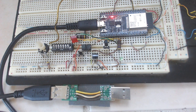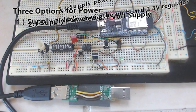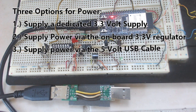When it comes to an ESP32 project, you've really got three ways you can power it. You can supply 3.3 volts to the 3.3 volt pin. You can supply 5 volts, or maybe a slightly higher voltage, to the 5 volt pin and let the onboard regulator supply 3.3 volt power. Or you can use your USB cable and let it power the device. I'm going to look at all three of these in a little bit of detail before I make my opinions known.